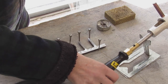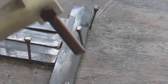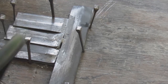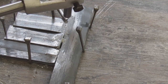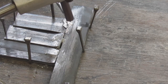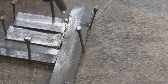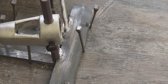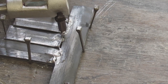I should lay that to rest while I reposition the camera for a slightly more challenging test — I'm going to turn it up for this bit. This is one inch lead meeting one inch lead because I wanted to try a long joint. If you're wondering why I'm waving it about, it's because of the hose. I'm not getting a very nice joint — it's pitting, and that's because this is not very nice lead; it's old lead.